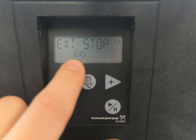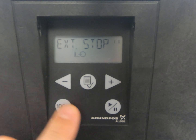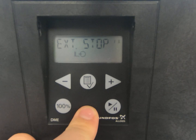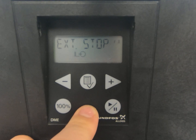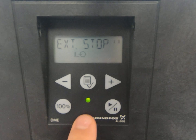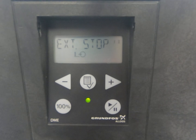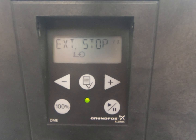Notice we have the external stop here — that just means it hasn't received a signal from the PLC yet. The last thing to check: if this light is blinking, that means it's currently paused locally. Press the play/pause button so the light is solid. At this point it's simply waiting for an indication from the PLC.